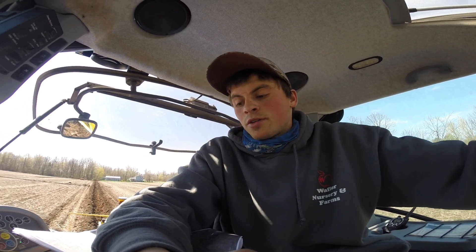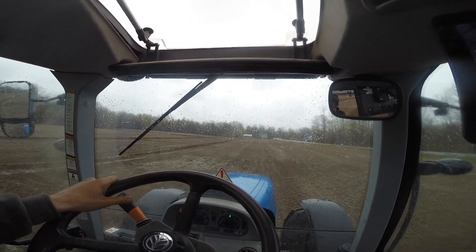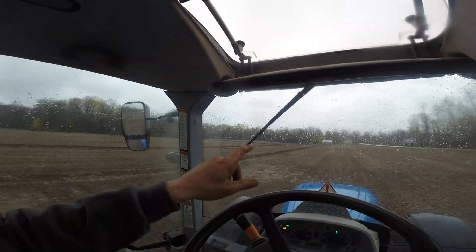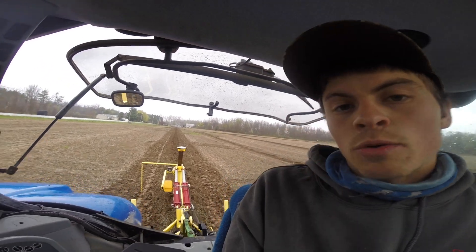This is the next day. We had a good day yesterday — we did that manifold over there and had some vents we had to dig into the woods for the system. Venting means bringing a pipe up to the surface so it can suck in air and won't suck in as much silt into the pipe.